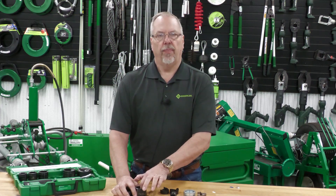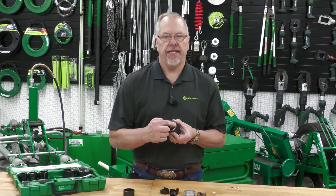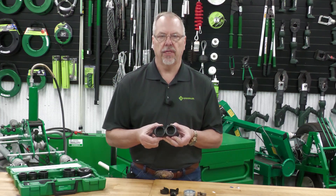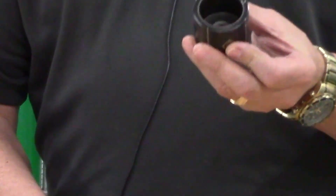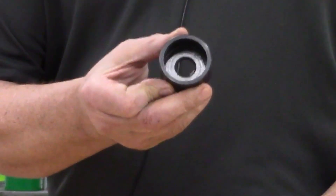The key difference with the overpunch protected: the punch will not hit the bottom of the die anymore, and the face of the punch is wider in comparison to the original dies. Why is that so important? The larger face allows you to now be able to do stainless steel. The original busters could not do stainless steel.